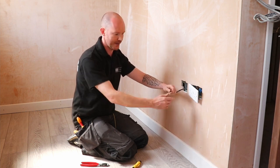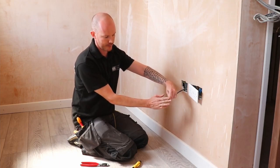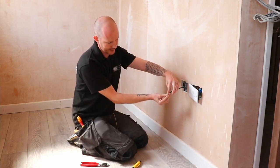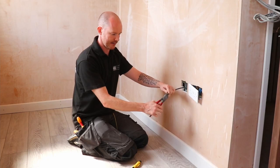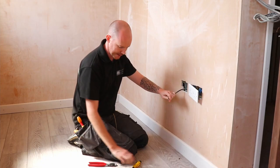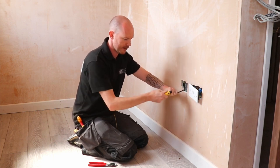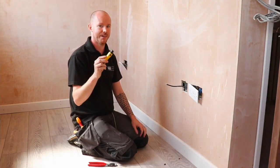That can go straight onto your F plug — perfect. That can go straight into your aerial; it'll clamp around the outside. The inner bit you just put in however far you need to, then cut it to length. As I said, you will not find anything quicker or cleaner than this tool — once round, pull it up, once round again. Perfect every time. Get one of these.